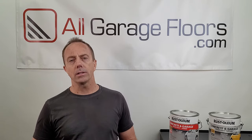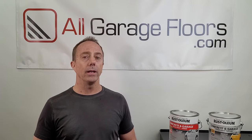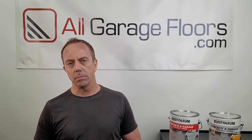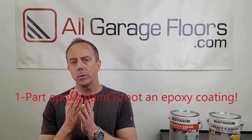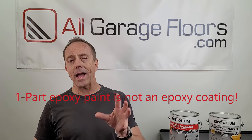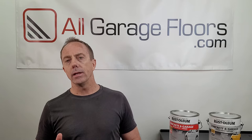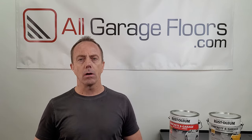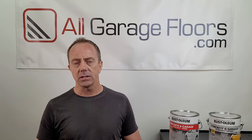The problem is that one-part epoxy paint was never intended to have a clear coat applied in the first place. With just one exception, which we'll talk about in a moment, clear coat sealers for garage floors are not compatible with paint or one-part epoxy paint — they are designed only to adhere to each other. So if you were to apply an actual two-part epoxy coating to your garage floor and then a two-part epoxy clear coat, they're going to chemically adhere to each other. They won't do that with paint. If you apply it just to paint, the moment you drive a car on it, it's all going to start peeling up because it's not going to stick properly. There is a way to get around that, though, and that's what we want to talk about here.